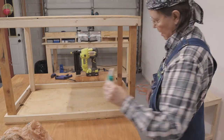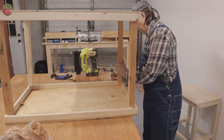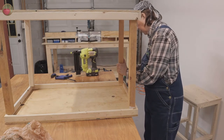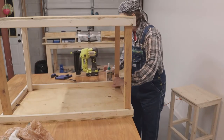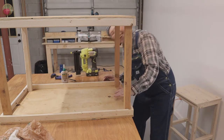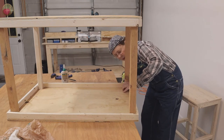I'm going to start on this edge. This is the tricky part — pulling it up enough to get glue in. You're going to have to do two sides at a time; there's just no other way to do this. I'm going to forego doing the bottom for this. Get that one back in there and look this one up — a little glue there, a little glue there, and spread it around just a little bit. Now I want to put the other side in because I don't want this thing, as the Appalachian folks say, side-goggling — crooked. I want it to be dead on. You can put your clamps on, but honestly it's probably tight enough to just hand-hold onto it. But you can put a clamp on if you want, especially if that makes you feel safer.